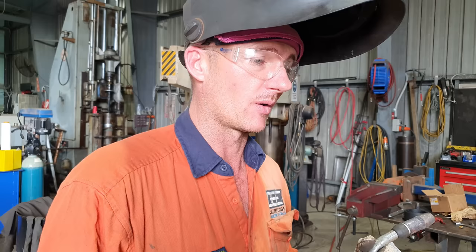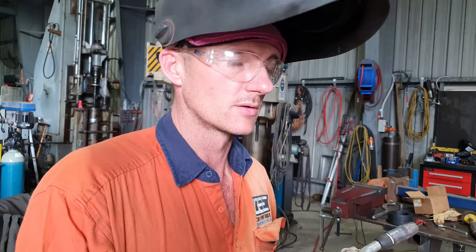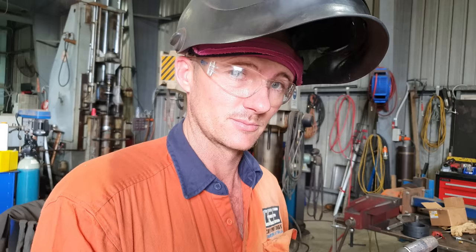I have seen it happen once before to another line borer for another company I was working for. Same sort of job, put a line borer on it, turned his back and the whole thing fell over and it damaged his line borer to the point it could not be repaired. So to avoid such problems, do things as safe as possible. Line borers are not cheap. Just tacking this to a trestle will stop any chances of this thing falling over.